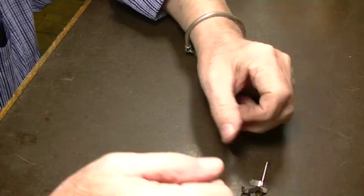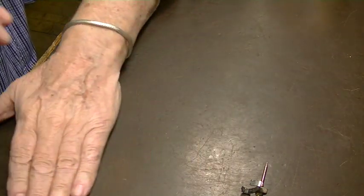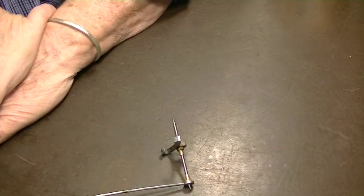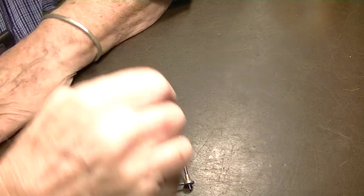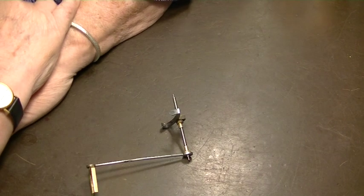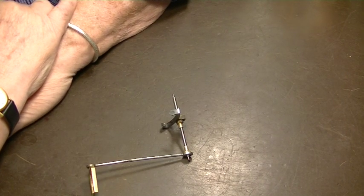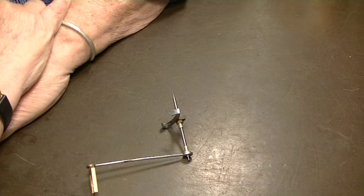That's a term that we use a lot, in beat, and that means that the tick and the tock of the clock is exactly the same. The time lapse between the tick and the tock is exactly the same. That's called in beat, and if the clock is not in beat, it'll run for a little while, but then it'll probably stop after 5 minutes, 6, 8 minutes.